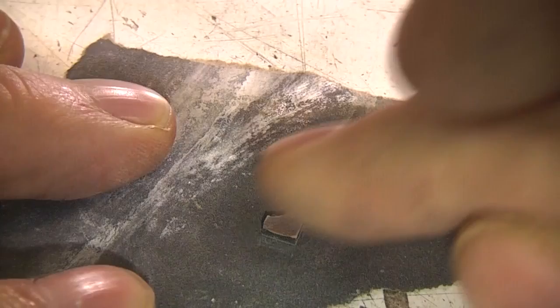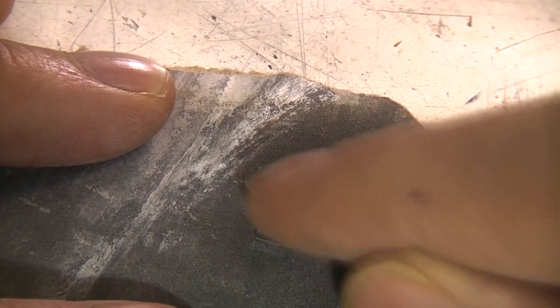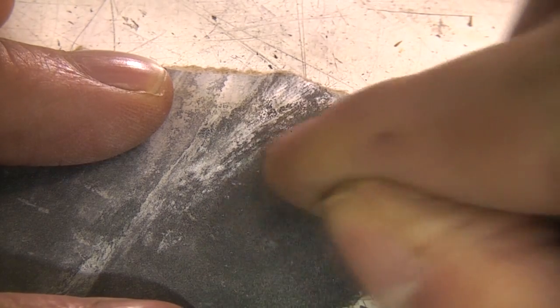Nothing obvious on the x-ray, so I think what I'm going to do is just try and grind this top window down just on this carbide paper, so hopefully we should expose the cavity and actually be able to see the die inside. This might take a while.